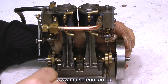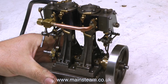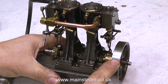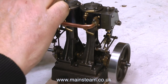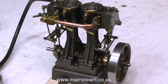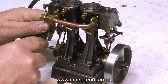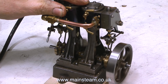I'm hoping this engine works fine after I've set the timing. I've produced videos showing in detail how to set valve timing on a model steam engine, but people still get confused when the engine has reversing gear. What you have to do is separate the two halves of your thinking: set the largest lobe of the eccentric at 90 degrees to the crank web, and you need to do this at each side, on the eccentric that is operating the valve spindle.